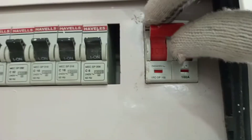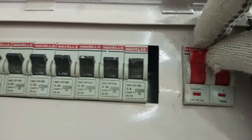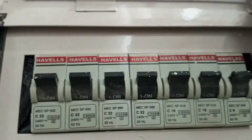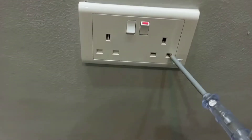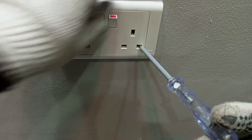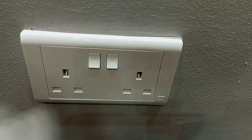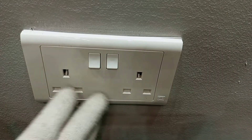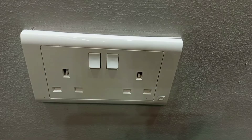This is the main switch — I can switch this one off and that puts everything off, but I don't want everything to go off. So I switch off the relevant breakers. I check again, and now it's off — there is no power here. Now that we are sure there is no power supply to this socket, we can open it and change it.